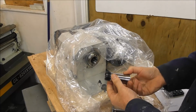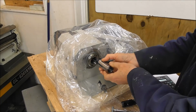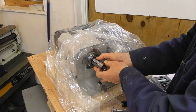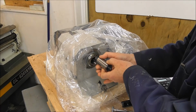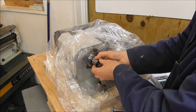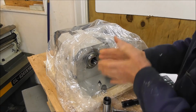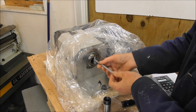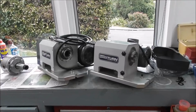Well, that's quite a good introduction to the idea of go-no-go gauges. So that's when you turn two plug gauges, for example, 1/10 of a thou undersize, so that would be just under, so it should go in, and 1/10 of a thou oversize, so it's just bigger than the bore, so it won't go in. And you mark on it go, no go. So when you're doing production machining, you check that the go goes and the no go doesn't go, and that's a quick, very safe and accurate way of checking that the arbor is on spec and saves this time-consuming, skillful use of, for example, a telescopic gauge. The old and the new.